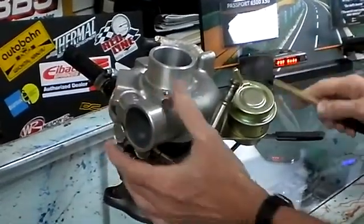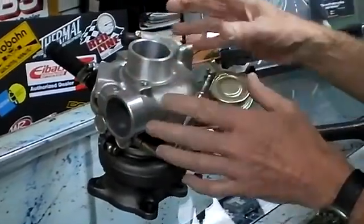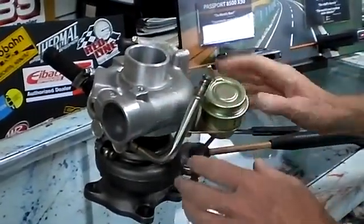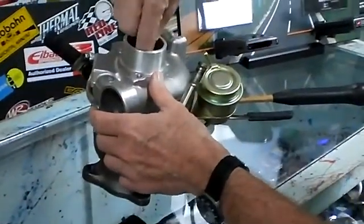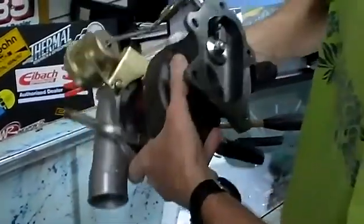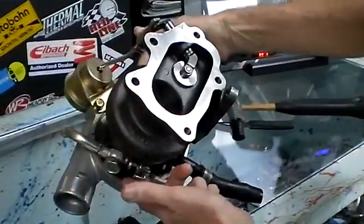And we clearanced it — we tapped it over. Now the O-ring is firm and we're talking very tight tolerances, so you need to be careful what you're doing. Do it slowly. We were able to get where we had, with slight pressure, no interference. We flipped it over and made sure our indexing was still correct.